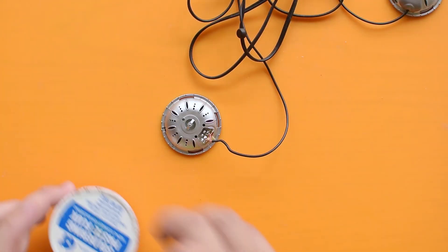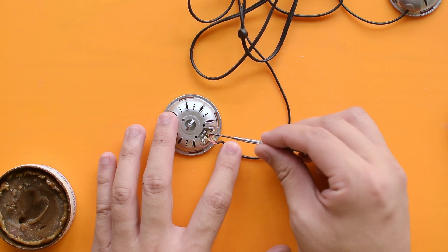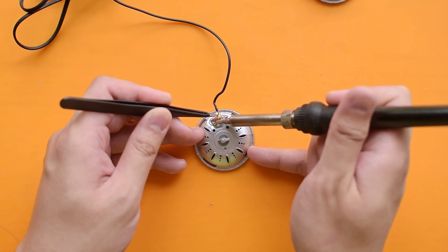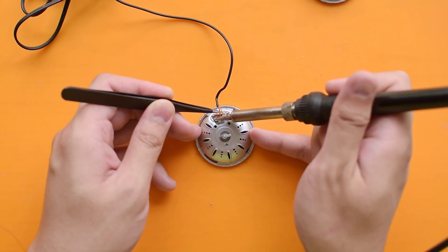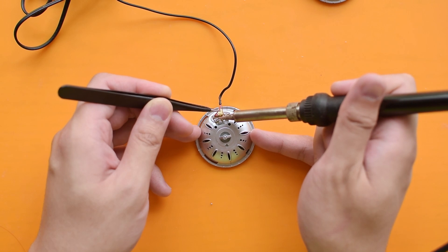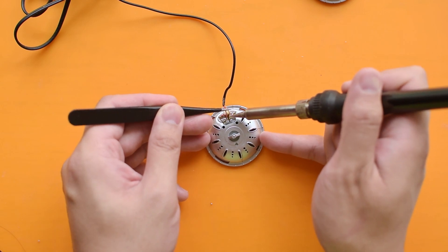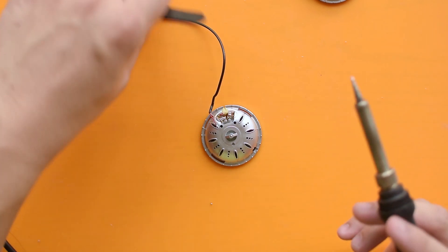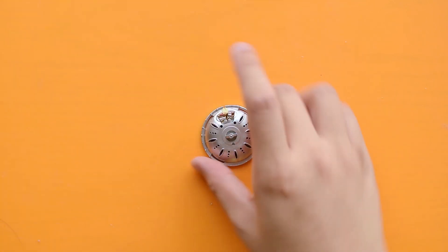Ground is on the left while the other colored cable goes to the right. To start my soldering process, I put some soldering flux onto both solder joints to ensure I don't heat it up more than necessary. Using needle nose forceps and my soldering iron set to 300 degrees Celsius, I touch the solder joints for a split second to quickly liquefy the solder so I can remove both wires. Solder melts at about 220 to 250 degrees Celsius, so 300 is a bit overkill, but it's never a good idea to have prolonged heat on sensitive equipment.